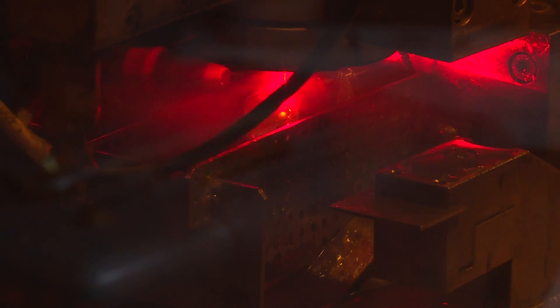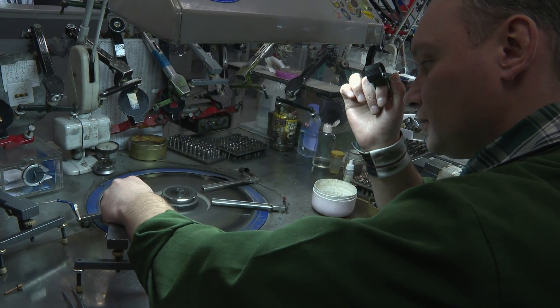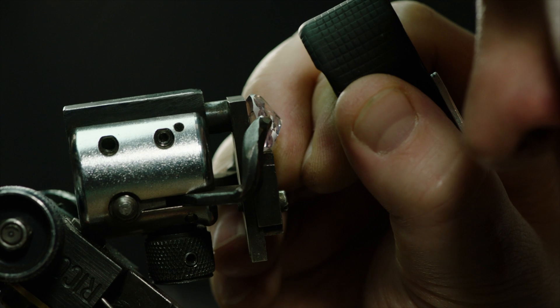This is the department where they cut the diamonds with a laser. You need to waste as little material as possible, so the laser beam needs to be as tightly focused as possible. At the same time, you don't want to heat the diamond too much because it's carbon and in principle it could catch fire. So you use a stream of water which focuses the laser beam to a spot about half the size you'd get in air, and at the same time it cools the diamond. One skilled polisher can remove a carat of material a day — that's 200 milligrams — but this machine can do it in 20 minutes. They didn't use this for the rose diamond because if something had gone wrong, it would have spoiled everything.